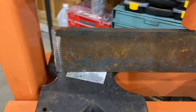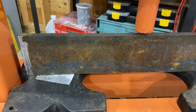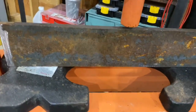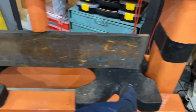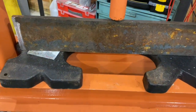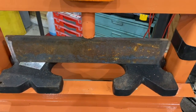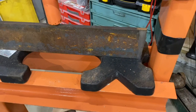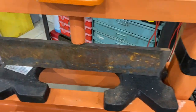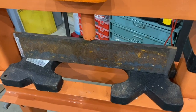So I now have this piece in here, and it was 20 inches - this is the way it's going to sit once it's all built. Now I'm going to make a bottom piece out of the same thickness metal and that will be the base plate for what I am going to bend metal into. So I'm going to make that one 22 and a quarter inches, so it's a little bit longer on each end. This will make sense later why I'm doing this.